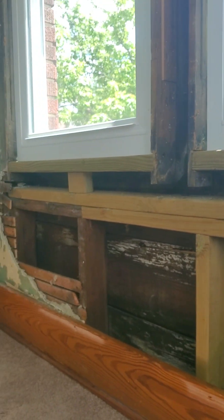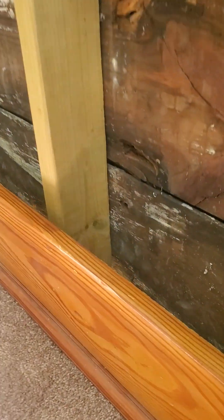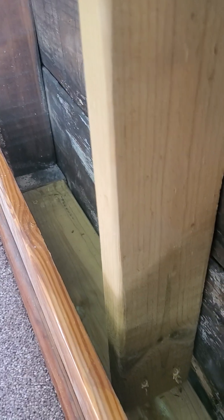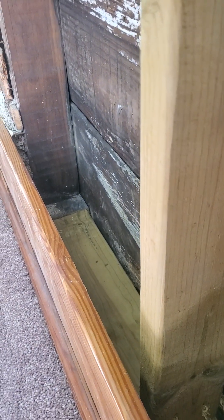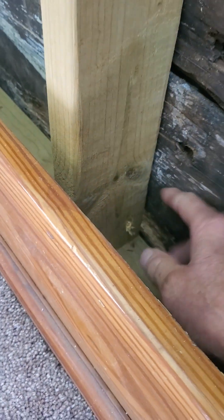There's our wall. We replaced this bottom joist on there, cut it off right there. Those little roto-zip tools are super sweet for doing this kind of stuff — cut right through it, nice saw blades cut through a 2x4 like butter. So we replaced that. Underneath that board right there is subfloor — it was a little bit rotted, but we can't really do much about that. Nothing's really eaten all the way through, and there's a brick veneer on the outside.